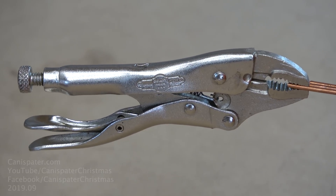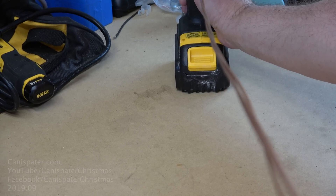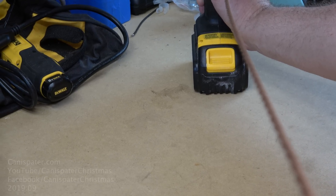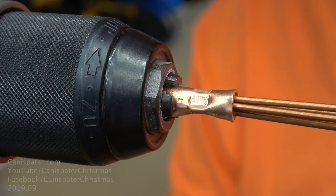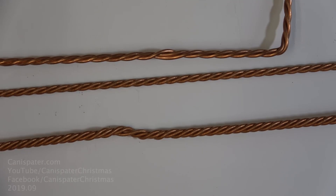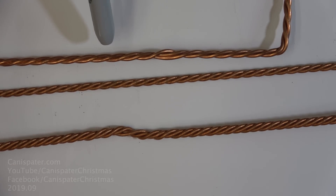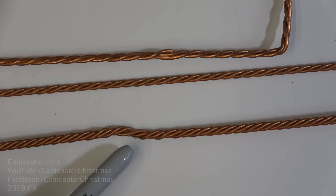Now just twist all three of them together the same way. It's best to have a vice to hold everything, or just make sure one end is pretty stable. I have a pair of vice grips. I also tried to twist four conductors together with this same setup — I couldn't get all four to stay in the chuck, so I put them inside of a butt splice first. This top one is the three conductors twisted together without pre-twisting them — you get areas where it doesn't twist up very well. The second one is three conductors of pre-twisted wire, which usually works out pretty well. This third one was four conductors — I probably didn't put enough tension on the wire while twisting them together.